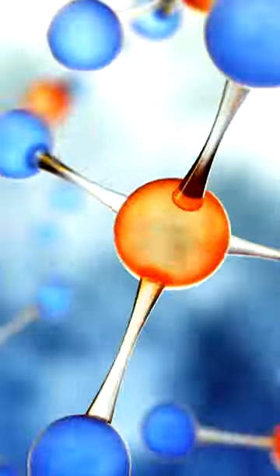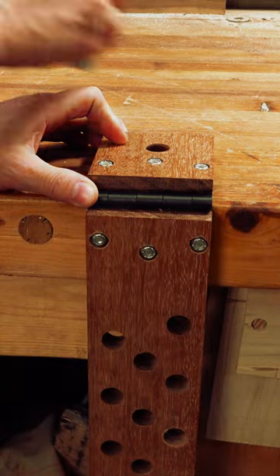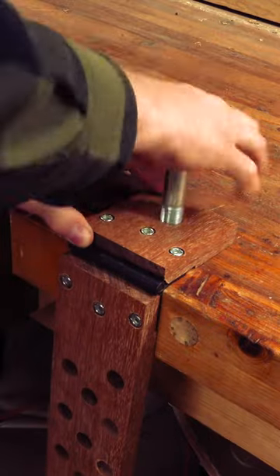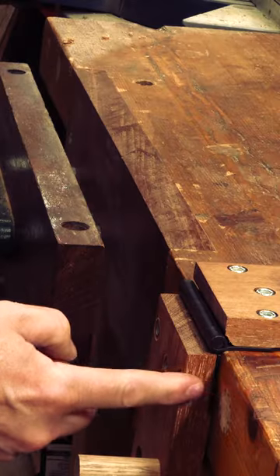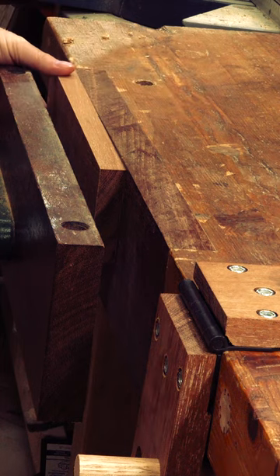You can't argue with physics. We'll create something called a board jack, and really all you'll need is a hole next to the edge of the top of your bench top. We'll use a door hinge attached to a couple boards. The tabletop board will get a three-quarter inch hole and we'll add a dowel. The second one that hangs off the bench will get rows of holes that are three-quarter inches in diameter. You'll need a third board that's the thickness of the other two. This will sit in your vise and give you clearance for your board jack.